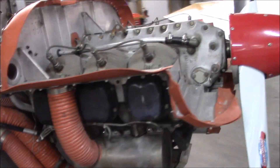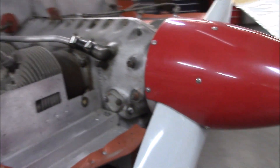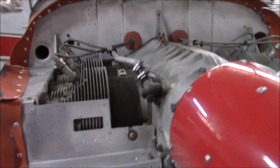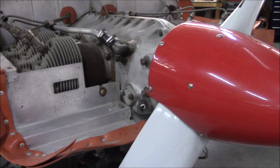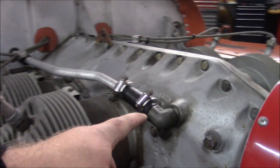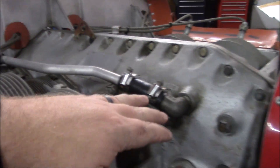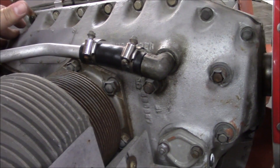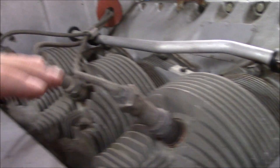It's a smart, simple design. It's a fixed-pitch propeller, just a very, very rugged, very good quality design. Here is the engine breather tube, so any additional pressure coming off the cylinders will escape through this tube down to the bottom — that way you don't blow your crankcase apart. And this being an aircraft engine, it has two spark plugs, one on one side and one on the opposite side down here, so you have redundancies in your systems.